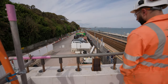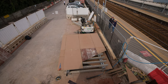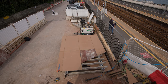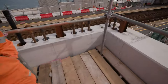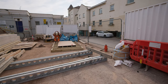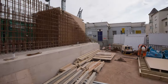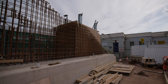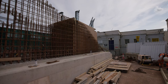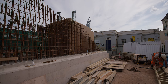Down on the floor you can see the shutters that the guys are preparing. These are fabricated on site and are for the walls behind us — they'll get lifted into position on Friday, which will allow us to form the shape of the walls, all poured in one stage. The guys are fixing and fabricating the shutters for the landward side staircase. On the left hand side you can see some shutters lifted into place where the bottom of the stairs are. This will basically form the base for which the precast stairs fit on — the ones we saw fabricated over in Ireland.